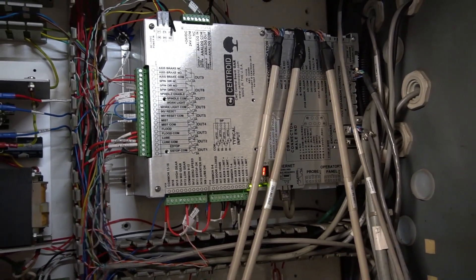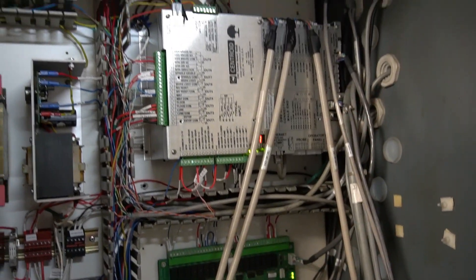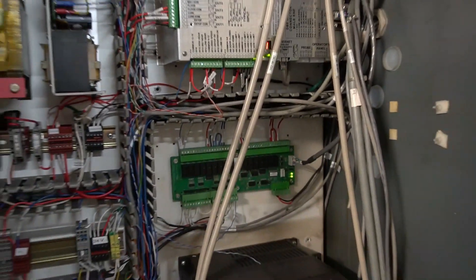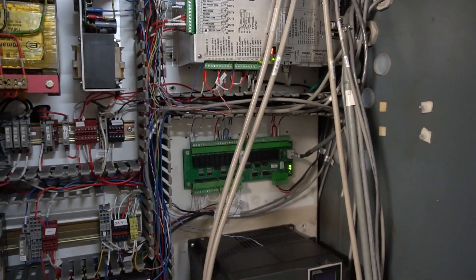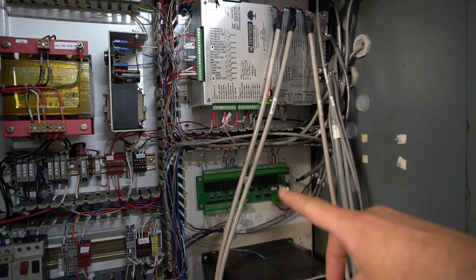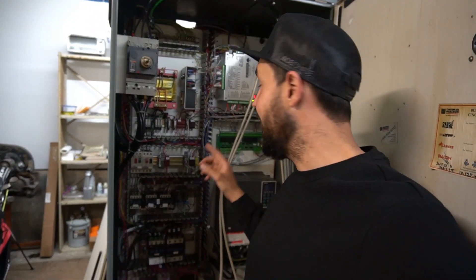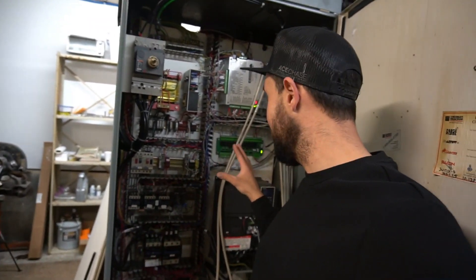This is the oak board — this is where pretty much all the control magic happens. It's telling the drives where to go, telling the umbrella to go in and out. And then a smaller version of the oak, a branch-off called the 1616 board, handles the limit switches, the tool changer, and a couple other in/out type things. Everything is labeled with a heat shrink label, so I know where to find things — which is a huge plus.